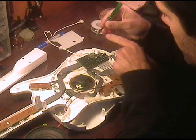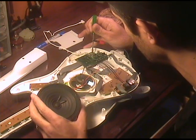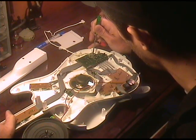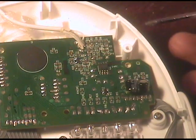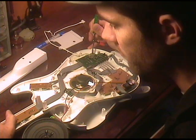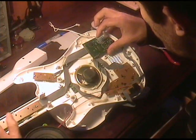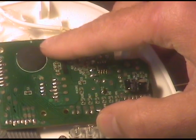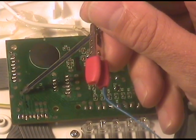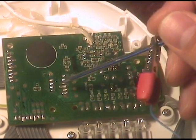Using my screwdriver here with the lead going back to the battery terminal. So that's like R2 and R4 over here at C8. R5 over here is the one that's responsible for our pitch. I've got the board now marked where the different points are that I can hit. That makes it louder, and I can turn on the different sounds from here using the pads or play the chords.